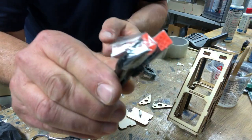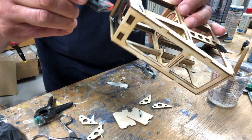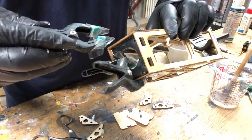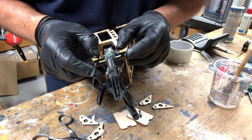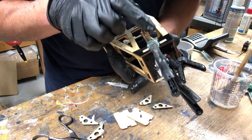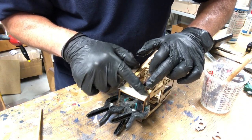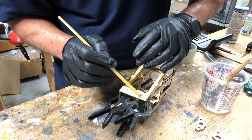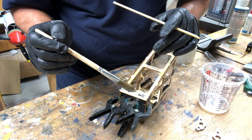I've covered these clamps with some plastic tape to protect them from the epoxy, and now you can position the clamps. Should you have pushed the carbon pieces out of place in that process, don't worry — if you have good gloves you can reposition them again and have them exactly where you want them. Now let's put the piece of glass fiber on the bottom. We have put some epoxy on it before — use some wood or a tool to position it and then soak it again with some epoxy.